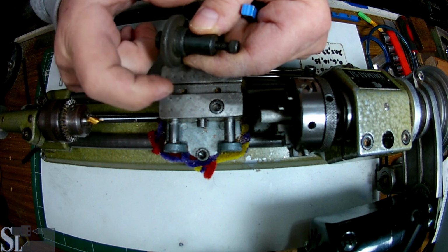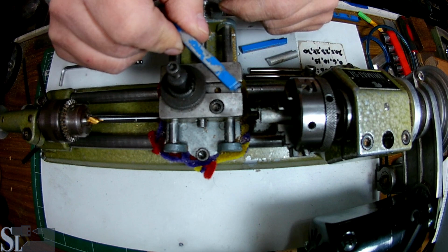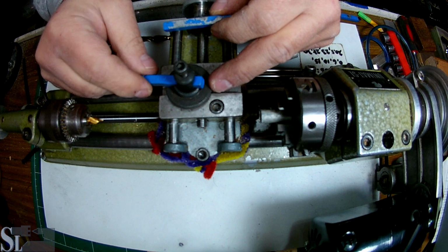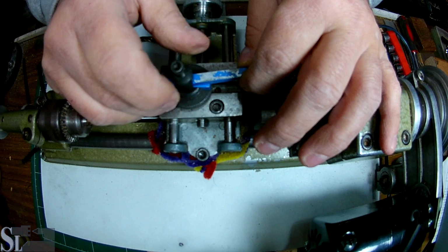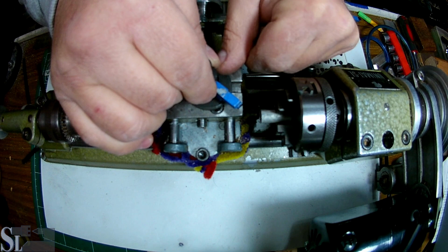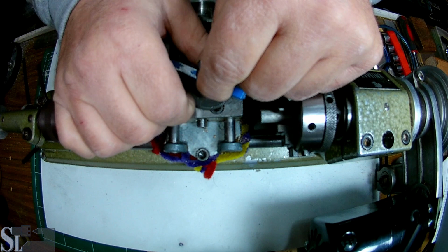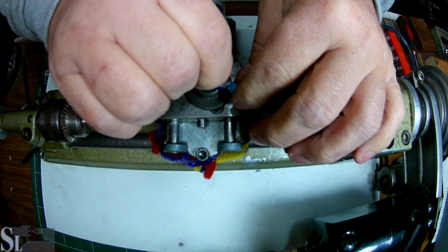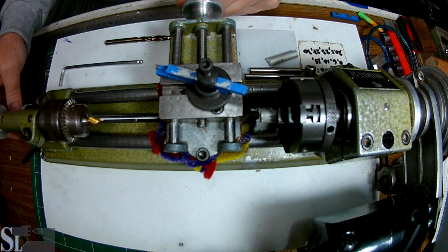And let's do a mock-up. To actually do some facing, we'll need this tool, which is usually used for turning. Flipped upside down, it's going to be used for facing. I'm going to need a spacer for it with another tool. This is the locking nut. I'm going to position them like so and lock with the washer underneath. One second there. There we go. Washer locked. Angle locked. These are thoroughly locked. And we can now adjust the height using this method.